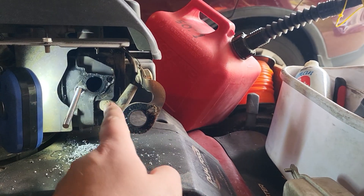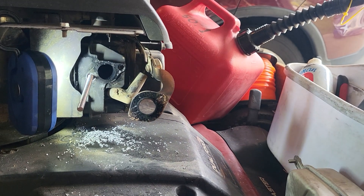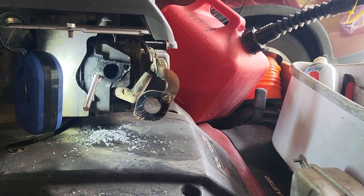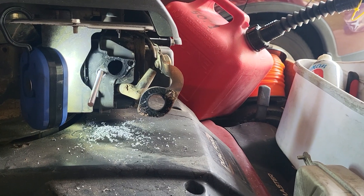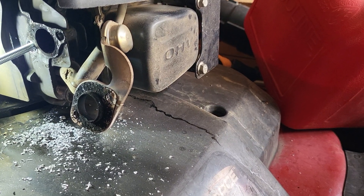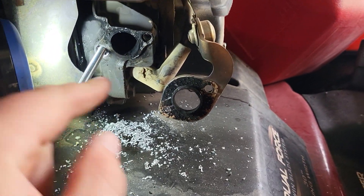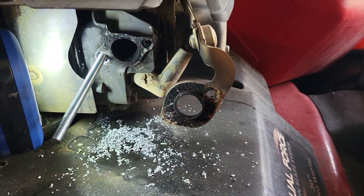For this other side, it is a through hole. I'm just going to put a quarter-20 nut on it, because behind here it's just the fins. So a nut will fit in there and I can hold it with a wrench, and then I don't have to worry about anything cracking or breaking off there.